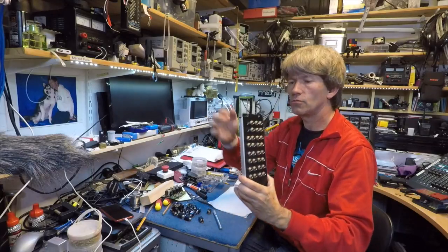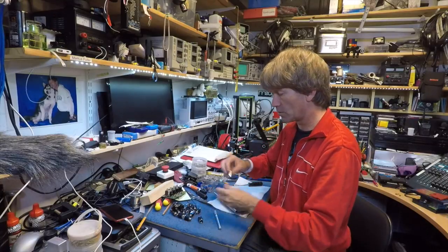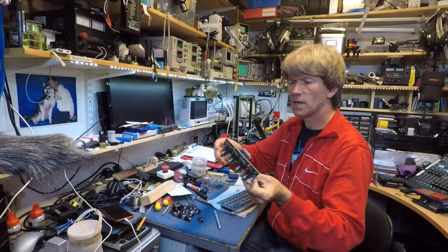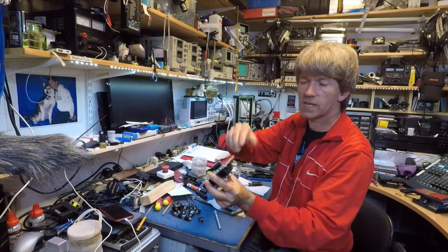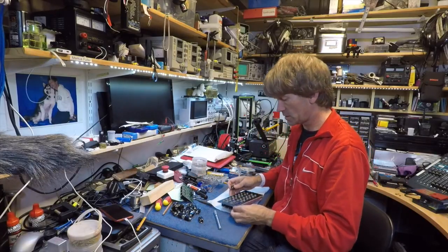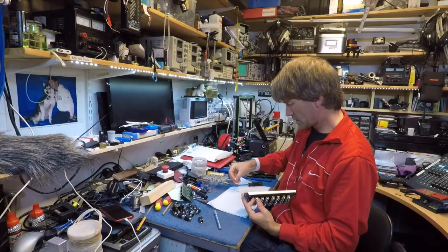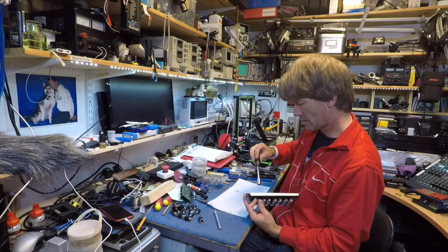So I'm going to put these last 2 pieces in now. Oh, by the way, if you remember the mixer I took apart a long time ago, an old Behringer mixer, that's where all these jack sockets have come from. I just knock them off the board. I use a hot air gun and heat the back up and just tap them off, and they all just fall off, and they're all completely usable and they're reasonably good quality. Well, they should be alright for what I want to use them for anyway. And just put these last two pieces on here, and then I'll go and see what it looks like on the machine.